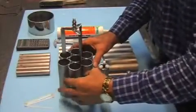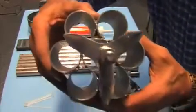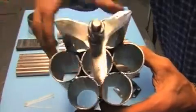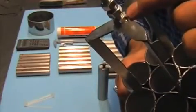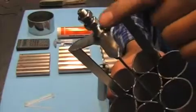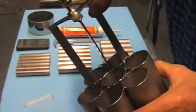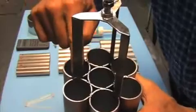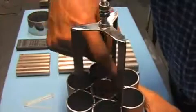I'll show you what I did with this positive outside of the cell. I welded it on all the connecting points of the tubes. Then I constructed a triangle and welded a bolt on it where I can screw on the positive electric entrance. Then I took about half-an-inch wide plates and went down to the three points as you can see. I suppose that an equal entrance of the electricity on these tubes will be an equal distribution of the electricity also.